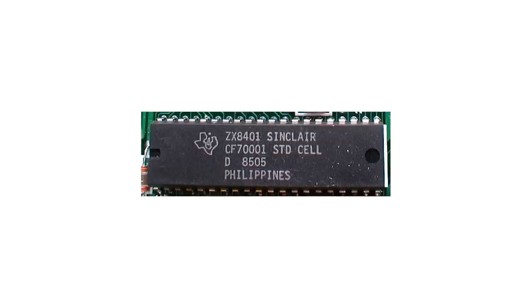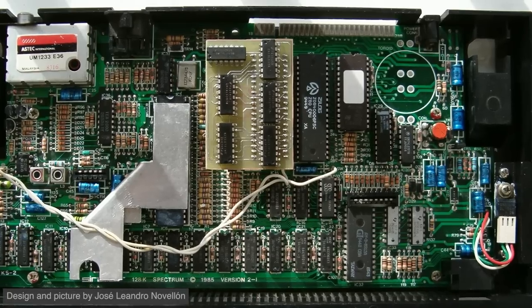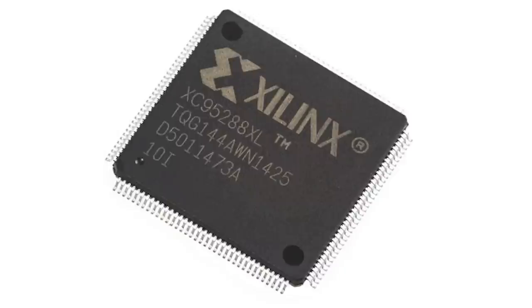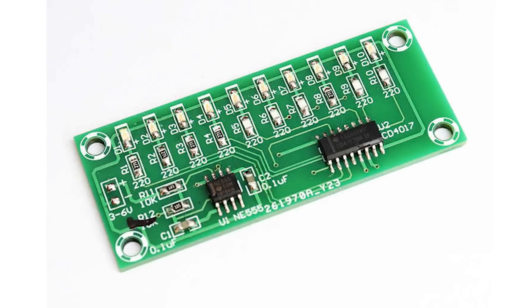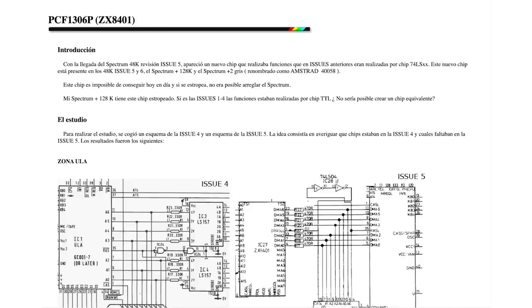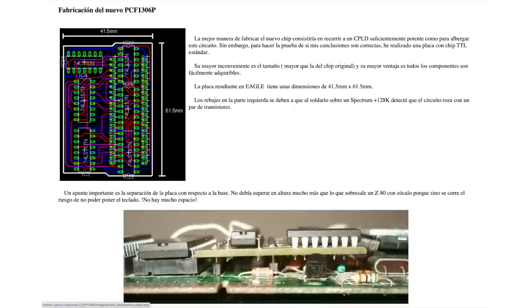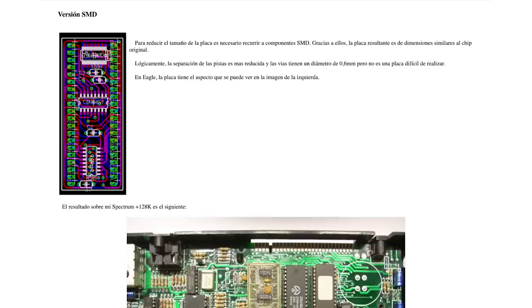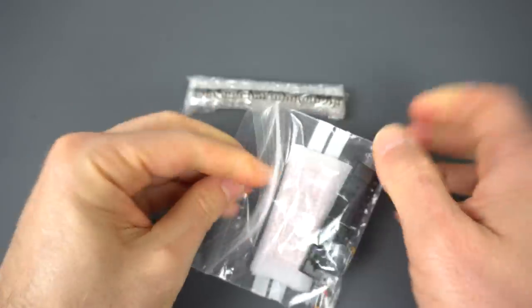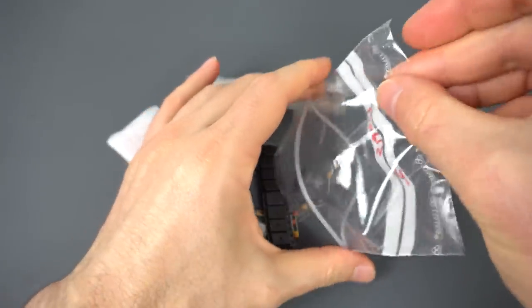Now that we know what's going on in that custom chip, how do we go about making our own version? We could do it with discrete logic, but it would get really crammed on those boards. We could use a CPLD — that would be compact but kind of overkill. Nowadays we could use SMD components to replicate the exact same original circuit with a much smaller footprint. Jose Leandro went through this reverse engineering a while back and came up with a design using through-hole components, and since that was kind of huge, another design using SMD components. Those designs are publicly available, and I put the links in the description. I coincidentally joined a group in a retro forum that created a batch of these boards and sold them as a kit — so here's that kit. Let's build them and try them out.